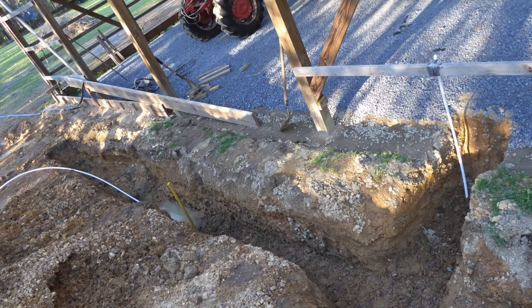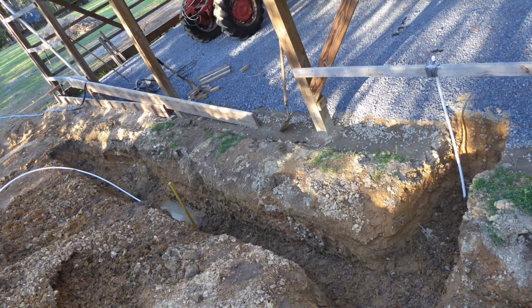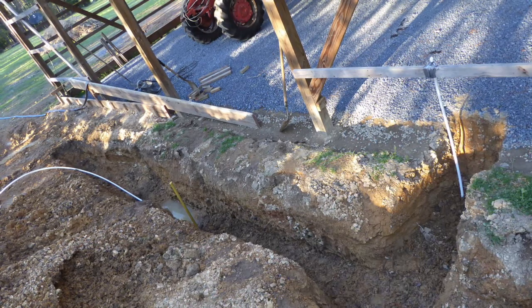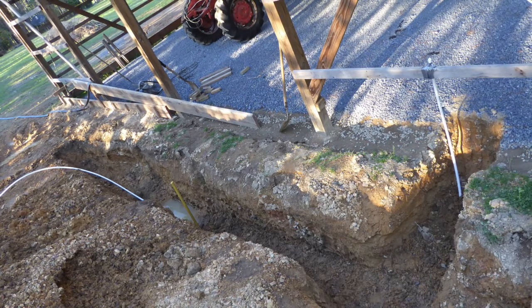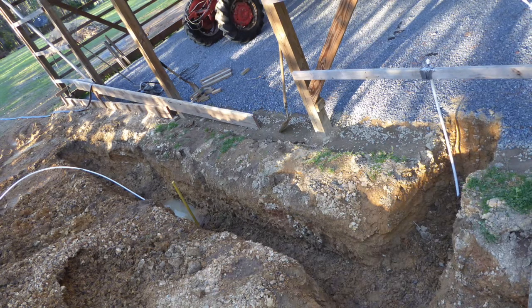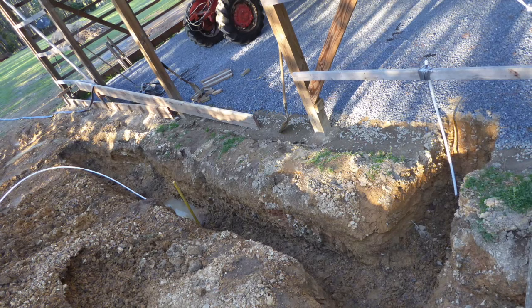The trench around the building was about 3.5 feet deep. It was run outside the structure because I did not want to trench through the floor of the building and thereby disturb ancient compacted dirt. It may not have made any difference, but I didn't want any soft spots under the concrete where disturbed dirt might later settle. As you can see, I had begun to put some fill over the PEX line.